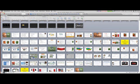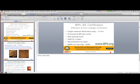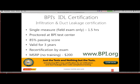Here we go. So BPI provides what's called the IDL certification. That's Infiltration and Duct Leakage certification. This is just a test. You just have to show up and show that you know how to do a blower door test, how to do a duct test, and how to do a leakage to outside test. And there's no written exam, and you are BPI certified as an IDL tester.